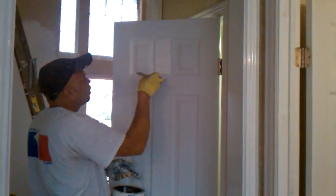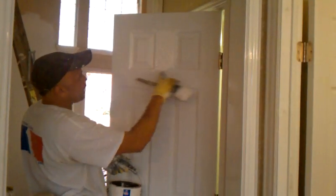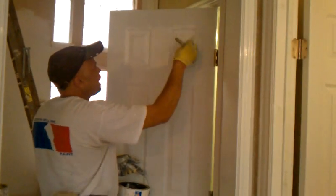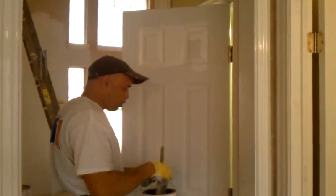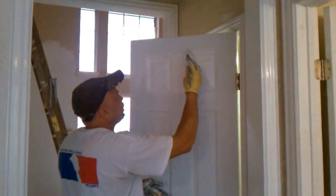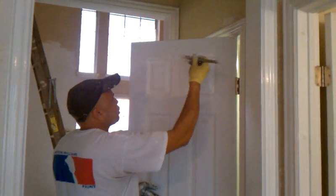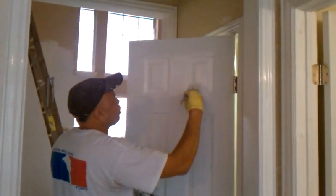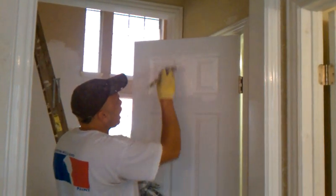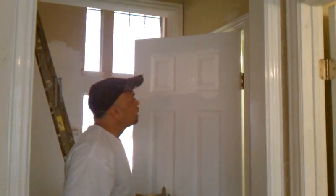I always like to come across here. You've got to do section by section. Otherwise, the oil base paint is going to set up on you too fast and it's going to be a fiasco. These are just practical steps when you're doing an oil base door. You notice I brushed it all out, and then I came back and drove the line straight, following the pattern of the grain.